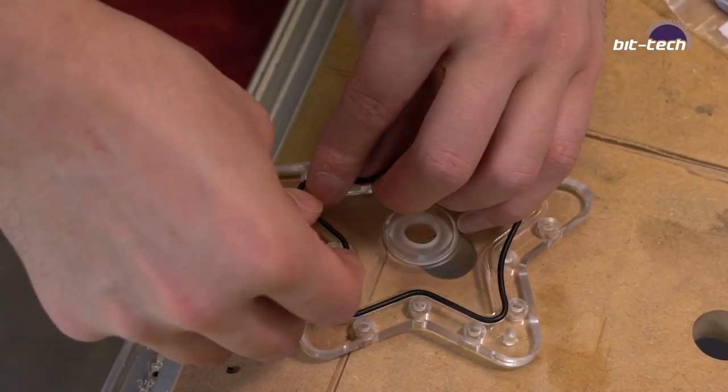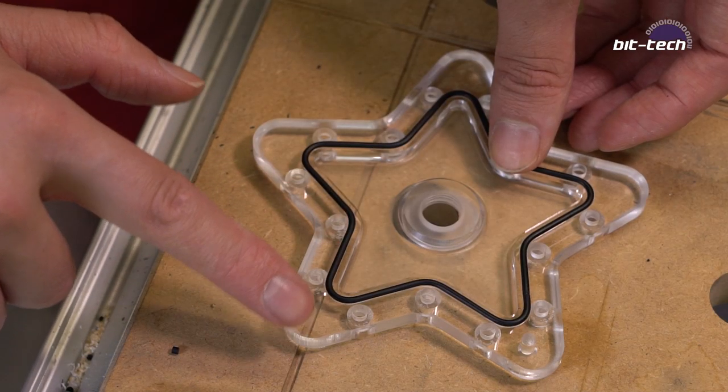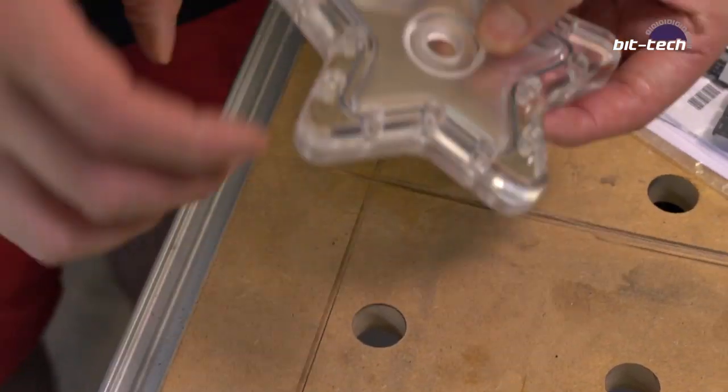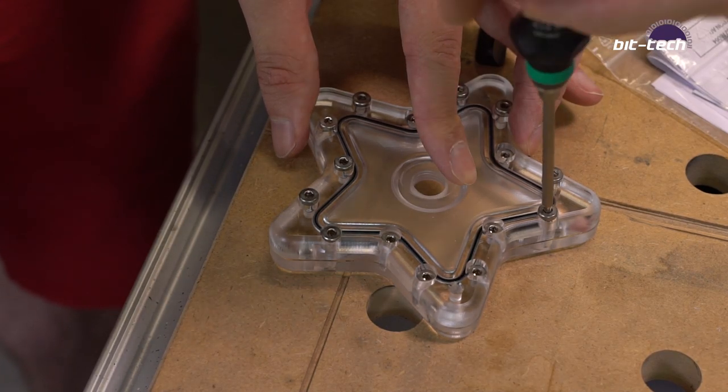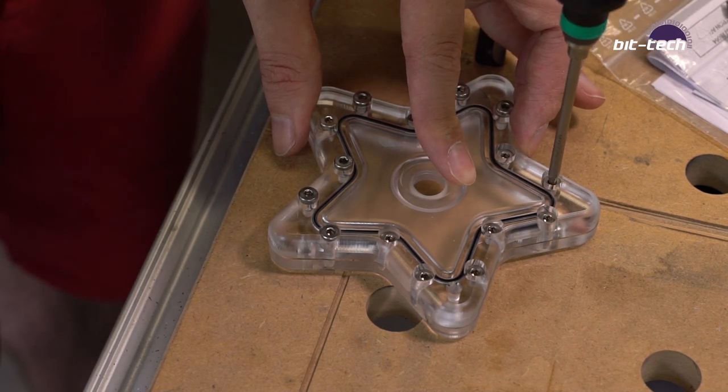We're going to just basically glue the O-ring together, put it into the groove, and then give everything just a little once over with a cloth just to clean off any of the other residual coolant and other materials from the machining. It should, if the theory holds true, be basically completely polished cut straight off the machine.